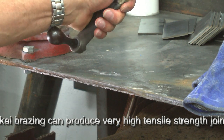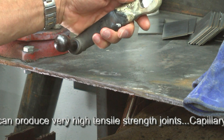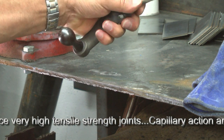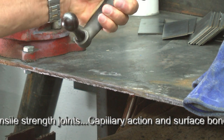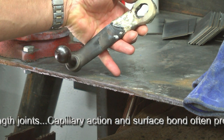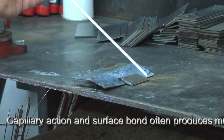You can see this surface has been ground and you can see that it finishes — there are absolutely no voids whatsoever. This has flowed in a way that we have consistency, and I'll be able to grind off this section and finish it just like I've done here. When I'm through, the handle will look as new and will be suitable for painting and so forth.